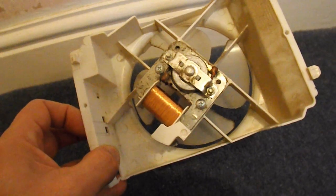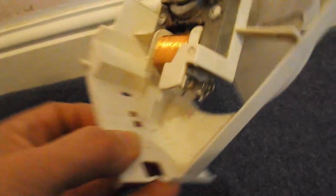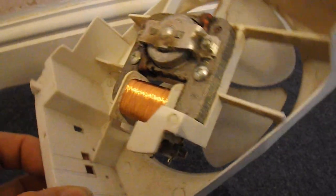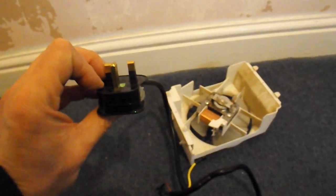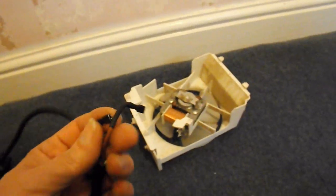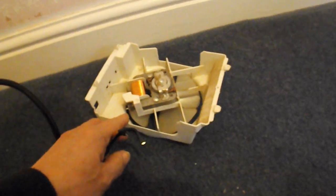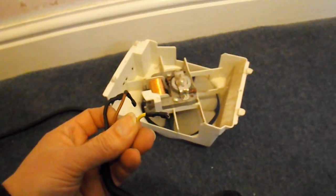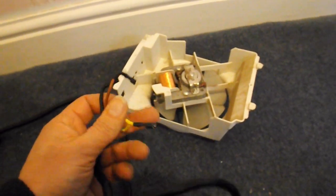How do we make a desk fan out of it? Well, it's mains powered. Those two prongs there are for the AC power to go into it. This one is a 240 volt one, so it runs on UK 240 volts. So I'll plug it in — I just happen to have a lead here already — a couple of spade terminals on it that we'll plug into those terminals there. Now this one's got the earth lead on it because we have an earth lead in the UK.